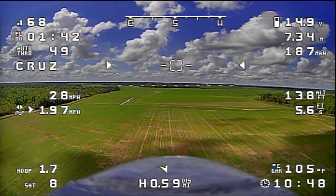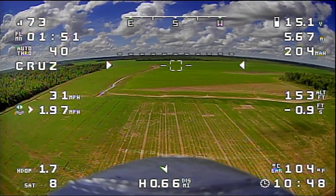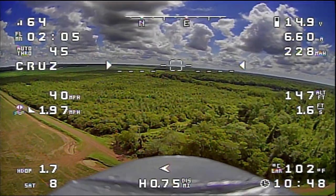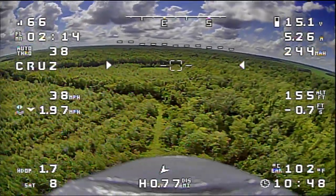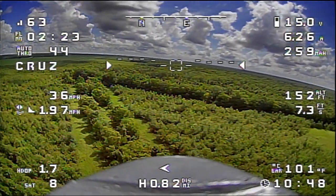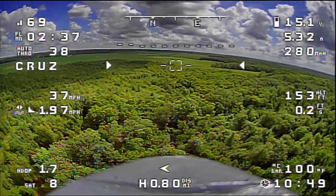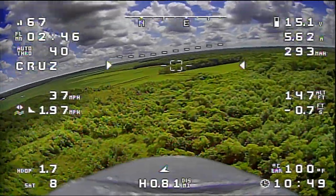Back to the other changes: the video. I added an LC filter on the 12-volt power coming out of the flight controller, powering the video transmitter and the camera. I did experimentation on the bench — I tried powering it directly off the battery, and also on the ESC output pads on the flight controller so the current sensor would measure it. The built-in filtering in the Caddx Ratel flight camera and the Matek video transmitter neither one was able to cope with the motor noise — it actually performed worse than running through the flight controller's regulated power. So I went back to the regulated 12V power and added an LC filter between the flight controller and the VTX/camera, and that seems to have eliminated most if not all of the noise.